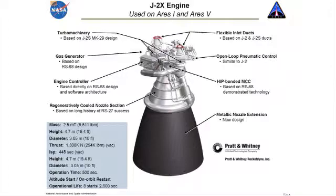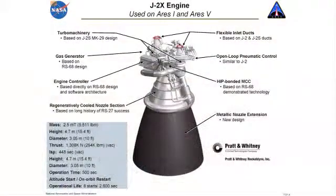The pneumatic control and flex ducts have their heritage in the J2. The turbomachinery is based on the further advancement of the Mark 29. At the end of the Apollo program, we were testing the J2S, which instead of a gas generator cycle would do a hot bleed out of the main combustion chamber to drive the turbo pumps. We never actually flew that, but the improved turbo pumps from that program were the starting point for the X-33 linear aerospike engine, and we've improved them even further today. It's the same gas generator cycle that all stages of the Saturn flew — so there's a heritage, and yet this is not your father's J2. It's a new engine.